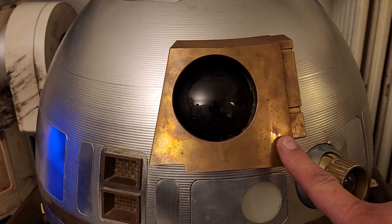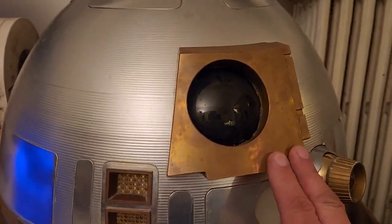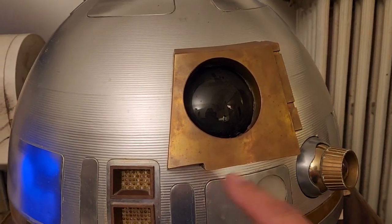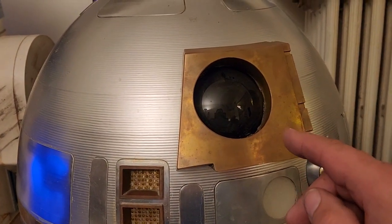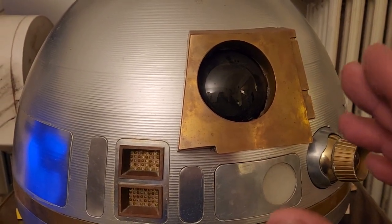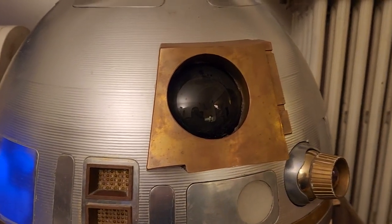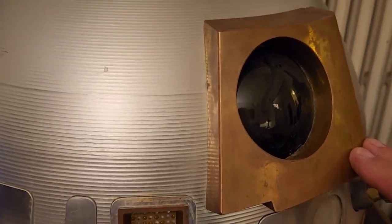It is sheet brass, very thin brass, probably about as thick as the cardboard you would find on a cereal box. This was made flat pack style, where I had a pattern on a sheet of paper, glued it to the brass, cut it out, and bent it, angled it, formed it, and shaped it. In the end it was really ugly because I had this whole thing bound up and held together by twisted jerry wire. Once I had it all together, I put it on a heavy-duty metal screen and attacked it with propane torches, and with solder and flux I soldered the seams.